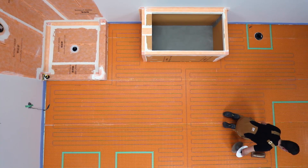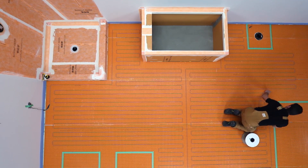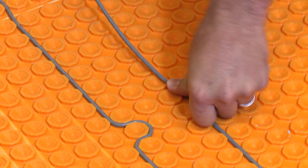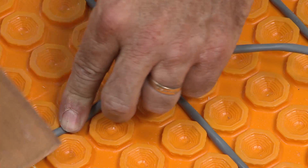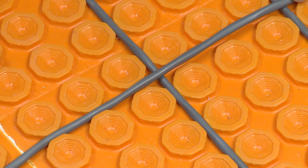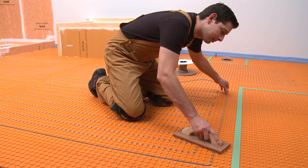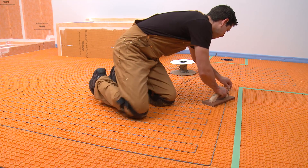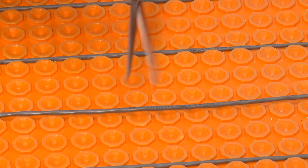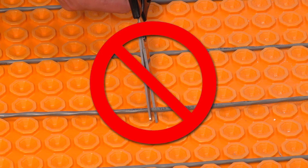In this application we split the floor into two areas to limit the longest single run of heating cable to 10 feet as required. Alternatively, the heating cable can be turned or a U-shaped jog created at 10-foot runs. The heating cable may not touch or cross itself or another heating cable. If you get stuck, simply remove and reapply the cable in a different pattern. Continue heating cable installation maintaining the required spacing between the cable and fixture locations marked on the floor. The heating cable must not be modified in any way or cut to fit the space, as this would change the cable resistance and could lead to a fire.